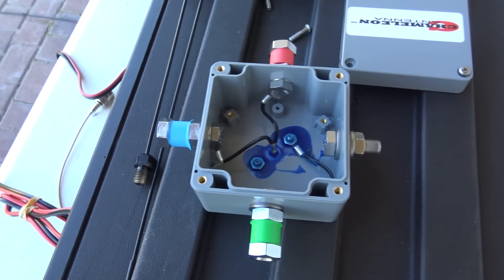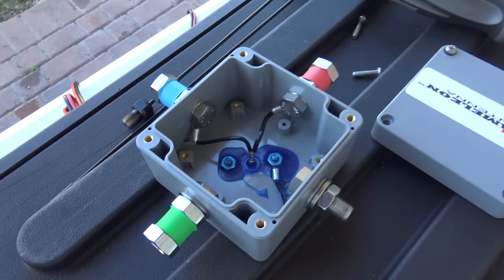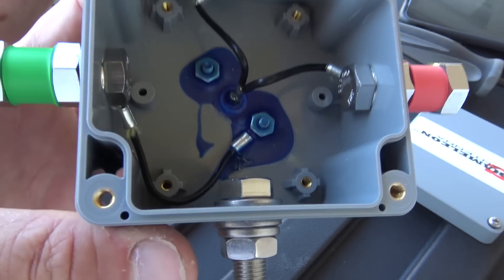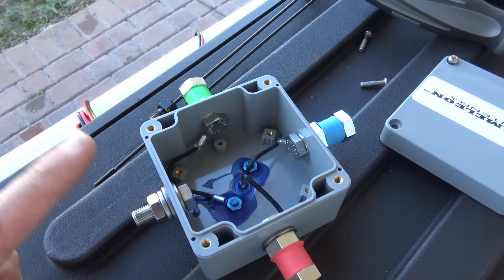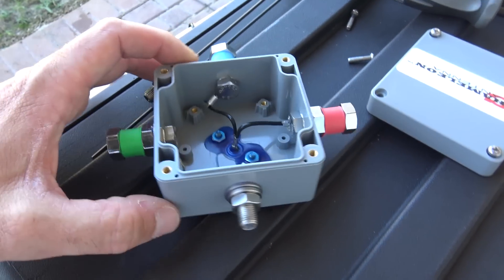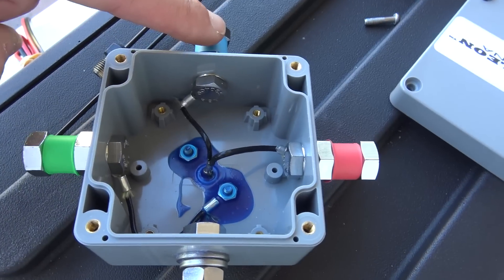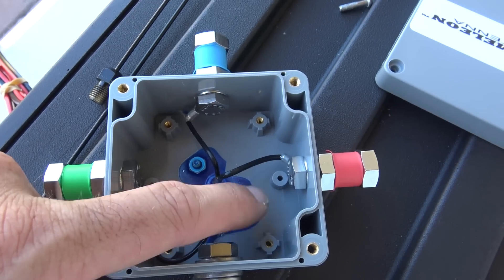It's a very simple idea, but it's the crafting that goes into it. This isn't a magic trick — they're not claiming there's some magic amplifier in there. From what I can see, it's molded ABS plastic with molded connectors for the screws. Now, if you look at this, this is what makes sense as to horizontal versus vertical. You'd have this mounted on a 3/8 by 24. Notice the SO-239 is in the back, and the center of your feed point goes to blue and also red.